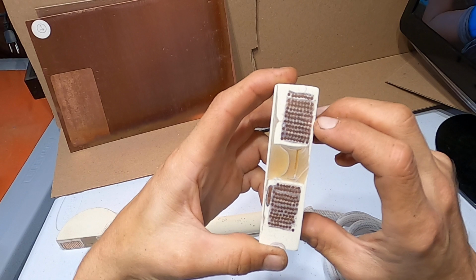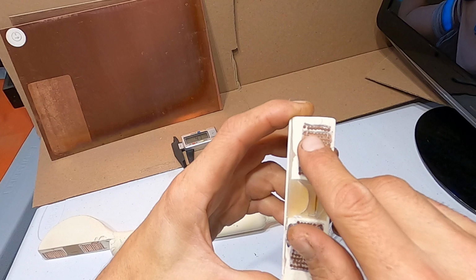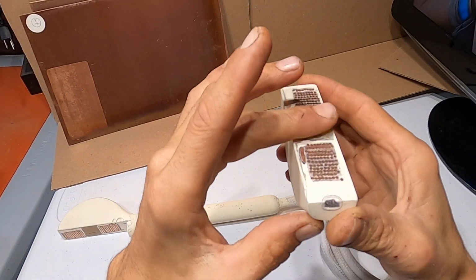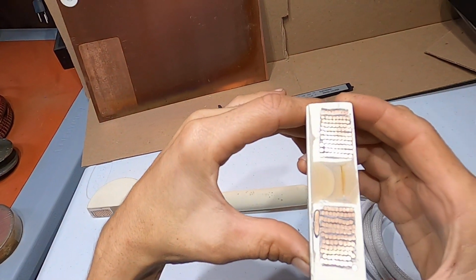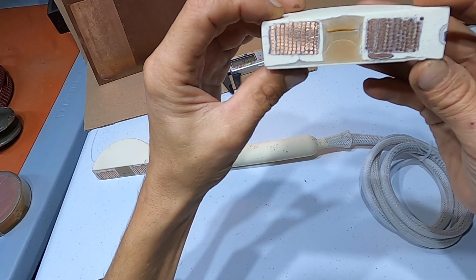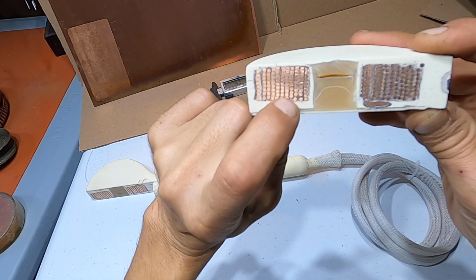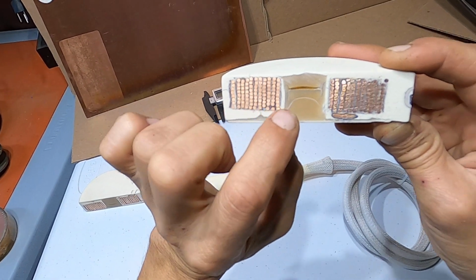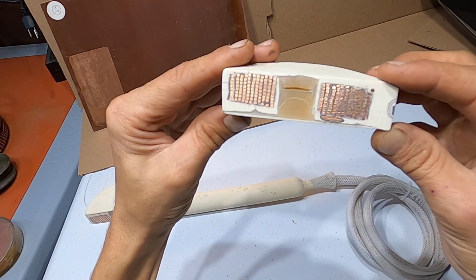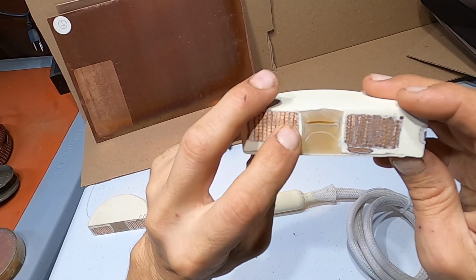As you can see also here, there are spaces in between the layers. I do not allow that to happen anymore. In this coil, you can see how the coil is made. See how close each winding and each layer is to each other. This is just for your reference. This is the same coil inside here. It's 400 grams, made out of 14 gauge copper wire.